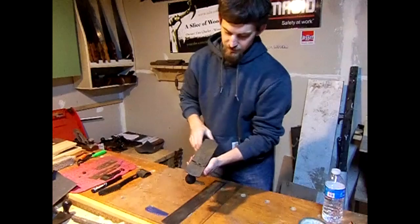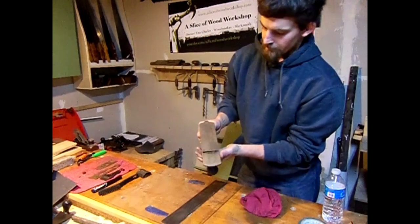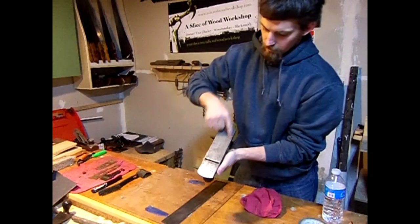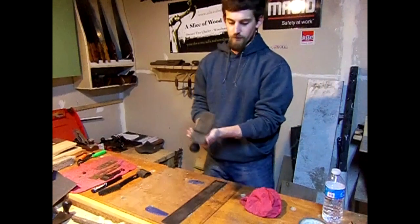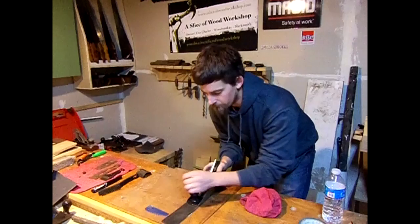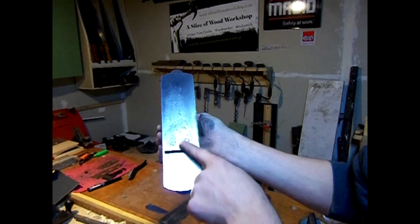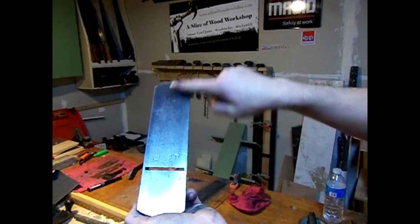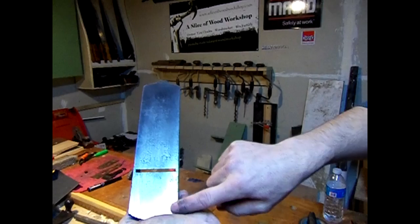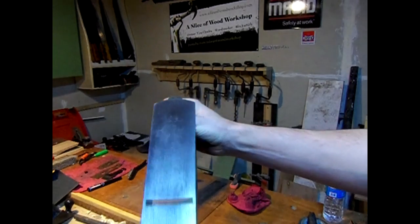I'm just going to check it real quick to see what it looks like. Most of it's already starting to come off — you can see I've still got my marks right here. I've got a mark on this side, but my mark on this side is gone, and the mark on the heel is gone. I have a little bit still on the toe, so we're just going to keep working until all those marks are gone. Here's the bottom of it — you can see it's got quite a few pits. The way I know it's completely flat is I drew back on with the Sharpie, made three passes, with one line along each side and two in the middle, and the entire Sharpie mark erased in three or four passes. So now we're ready to move up to the next grit.